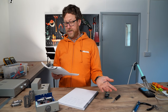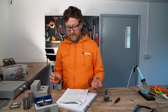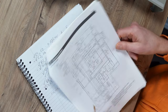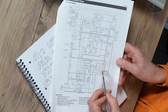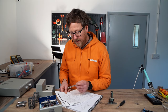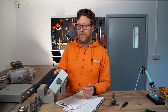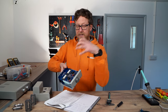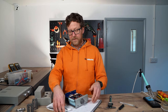Another key one is your power supply cap — there are going to be a few in the circuit. They're generally quite big and high voltage, because valve amps run at high voltages. I can identify C13, which is 22UF 350V, and C12 and C11. We might be able to change them, we might not — it all depends on how much room we have in there. Before I do that, I need to talk about the size of these components.